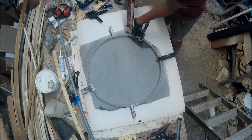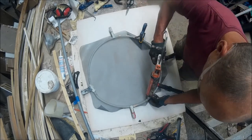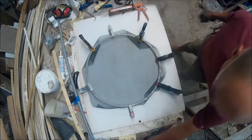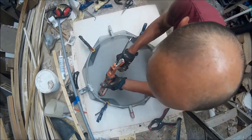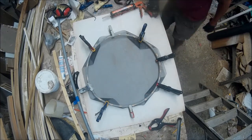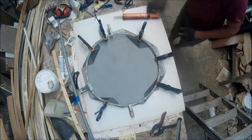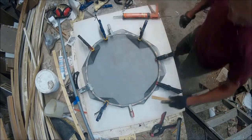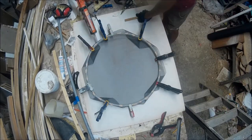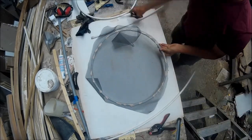Now I'm going to go ahead and apply a clamp and apply some adhesive. I tried silicone, but when it dries it's very slick and doesn't adhere very well. We're using NP1, which is a urethane caulking — it's a roofing material but you can also buy it at Lowe's or Home Depot. Urethane is a very good material that lasts a very long time. Because the pipe is plastic, not a lot of things stick to it, so this urethane is a very good product — it has good long-term longevity and good UV stability.